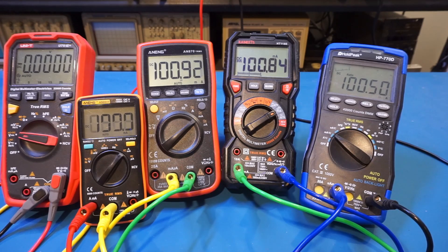So while you can use the amp current range to measure milliamps with just about any multimeter and get that significantly lower burden voltage, the meters shown in this video give you that one extra digit for improved accuracy. I hope you enjoyed the video and learned something new. If you liked it, please give it a thumbs up and subscribe to this channel for more videos like this in the future.